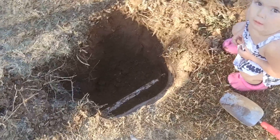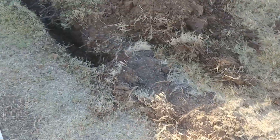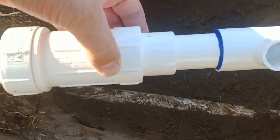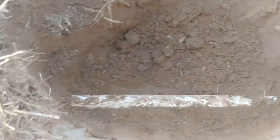Here I decided I need a sprinkler, and because of the other digging I've done, I knew where the line was. This is a one-inch line. What I'm going to do is cut that and install this piece in there — this is a slip coupling — so I'll be able to put that in there without digging up more line.